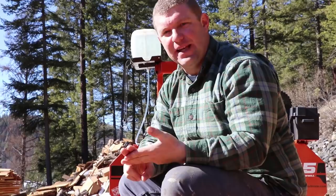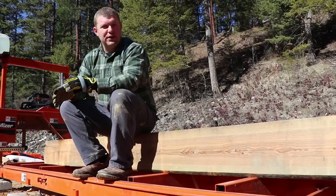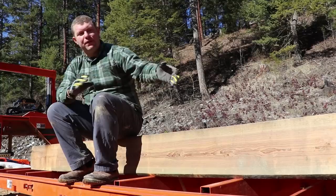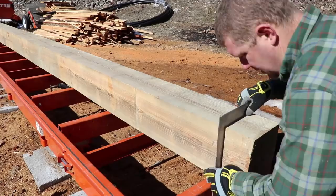What we need to do is re-saw three pieces. But if my math is right, that would probably take all day. If there's one four-letter word I've learned while running this sawmill, it is calibrate. The biggest challenge in milling our timber frame accurately was the way our sawmill is founded on the ground. When you roll big beams over and drop logs, the saw gets miscalibrated very easily. To get the precision we want, we're going to spend a lot of time adjusting the sawmill and very little time making sawdust.